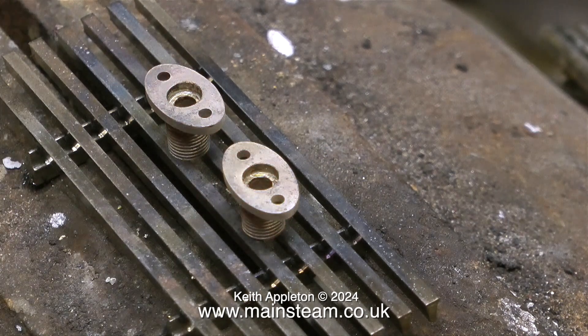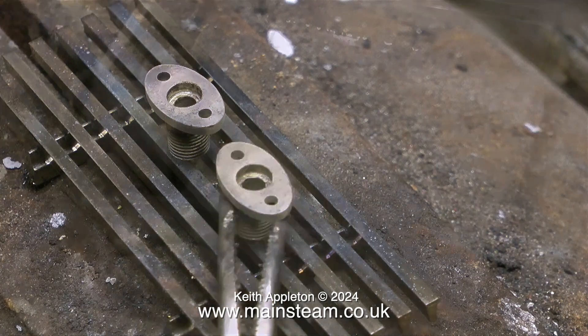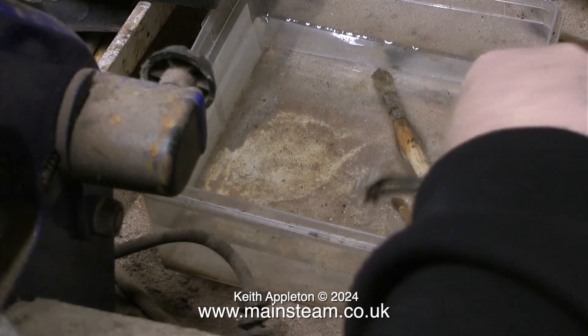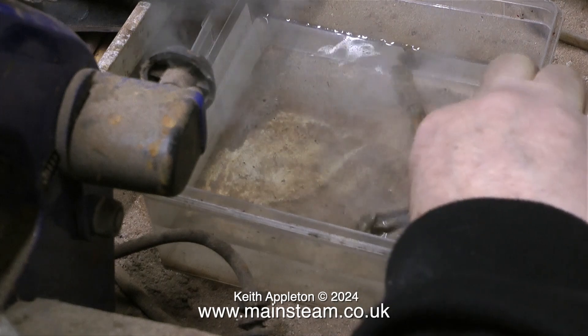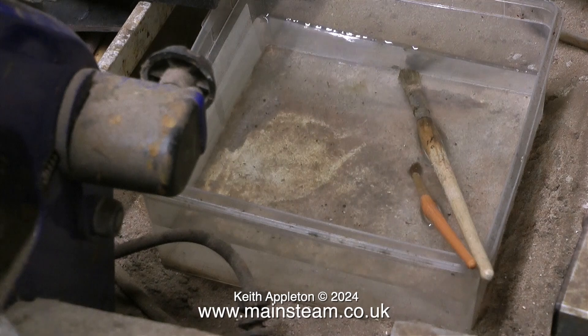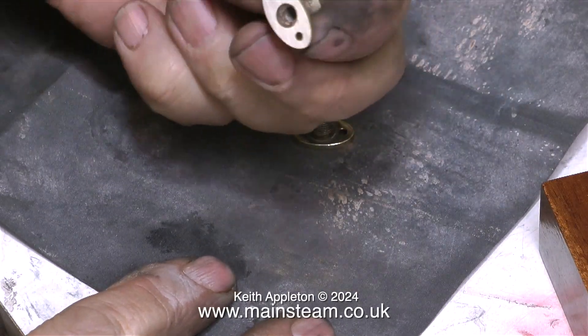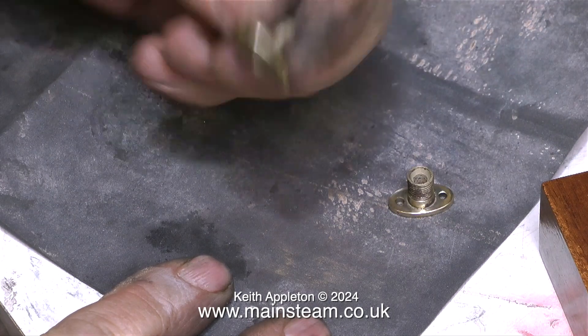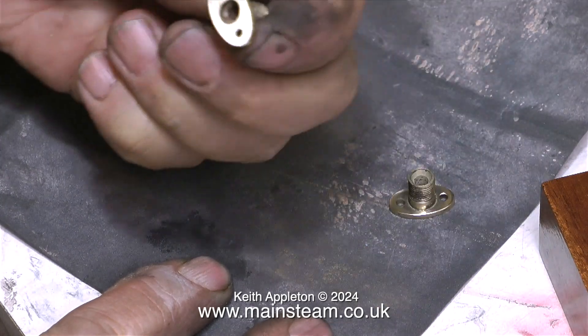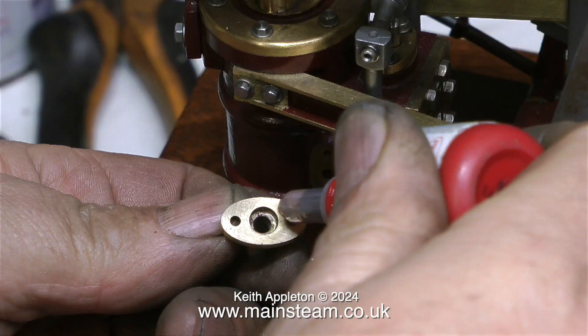Plenty of heat — when it gets to red heat I apply the solder which flashes around the joint. Normally I use sticks of silver solder, but when using the wire type remove the blowtorch slightly before applying it, otherwise it's likely to melt and drop off before it gets near the part. Once the components have cooled to black — meaning they're no longer glowing red — quench them in water. Not only does this make them safe to handle, but the thermal shock removes some of the oxidized scale. The only problem with silver soldering compared to soft soldering is the intense heat means you have to spend time cleaning up the parts. I cleaned them up on the polishing spindle and they look fine.